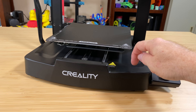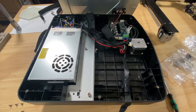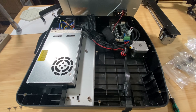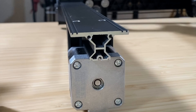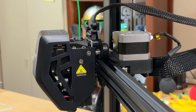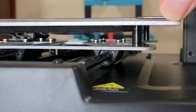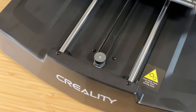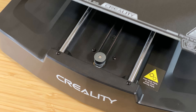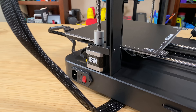So let's get right into the printer's specs and features. The printer has an injection-molded plastic main body and aluminum extrusions for the X and Z axes. There's metal reinforcement inside the plastic body between the gantry mounting points. The Z extrusions have a crazy profile to them, but the X extrusion is a standard 20x20mm one. Both the X and Z axes ride on V-slot wheels, while the Y axis rides along a pair of steel rods using linear bearings. The Y motor is embedded in the main body at the front, the X motor is in a new location behind the tool head which makes it more compact, and the Z motor is in the usual place behind one of the Z extrusions.